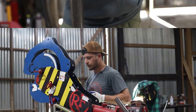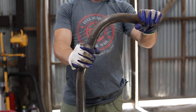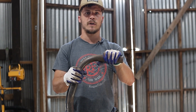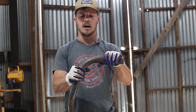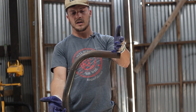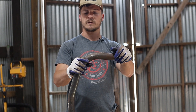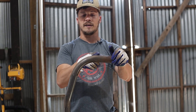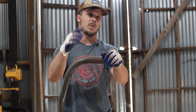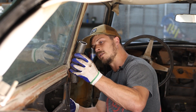These are our two bends that make up 90 degrees — 74 and 16 — and we're going to use these to calculate how much straight pipe we need. You can use math for this, or programs like Bentech, but I'm not the greatest at math and I don't have Bentech, so this is what I'll use. This sample bend section costs around three to four dollars, so it's a little wasteful, but it gives me a better idea of how much space the actual bends take up. I'll be able to lay it up in the car and make sure it's going to work before we bend our 25–30 dollar piece of tubing.